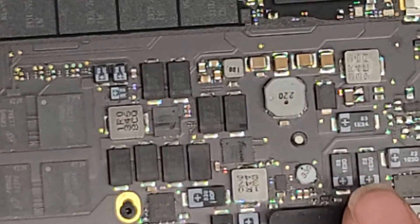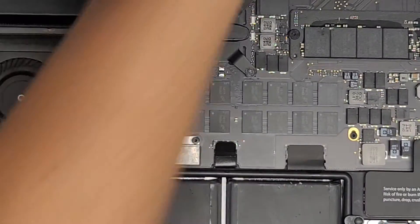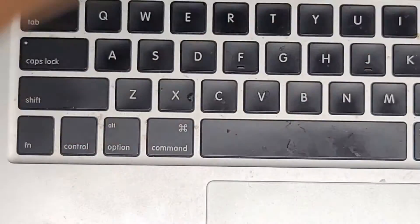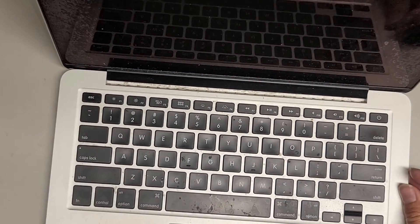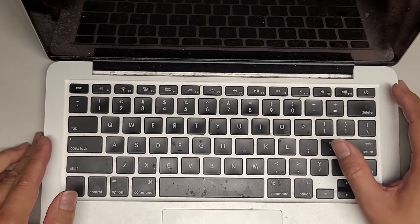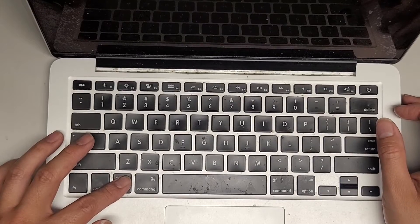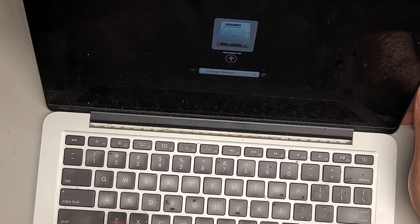Let's try and power it up. Let's push the battery connector back on. Let's put the cover back on. We're going to do an SMC and PRAM reset if it works. If not, we're going to try getting the connector on the back end here. Power button — holding the option key so it doesn't risk damaging anything. And I see light, so we're good.